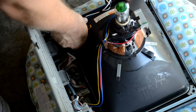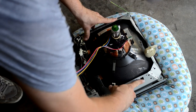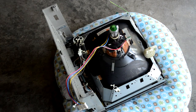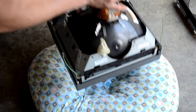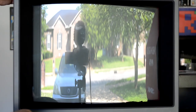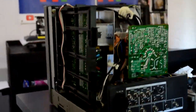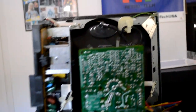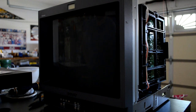Next I'm reinstalling the shielding that includes the degaussing coil. I'm not using the 1350's original shielding and degaussing coil because it was also damaged, but all you need to do is install the four screws back with the shielding in place and the tube is mounted and ready to go. Everything looks good around back, and checking the front of the screen I want to make sure there are no open gaps between the screen and the bezel — and there aren't. I've gone ahead and reassembled the monitor completely, reinstalling all three major boards and connecting all the cables.